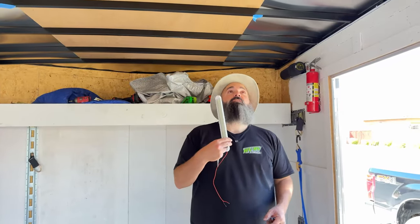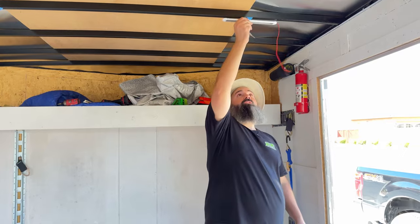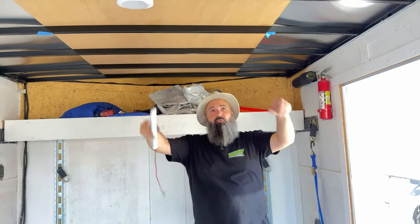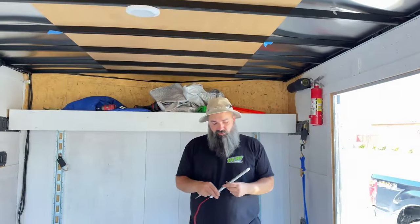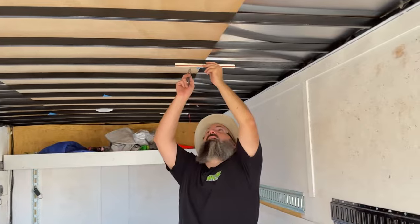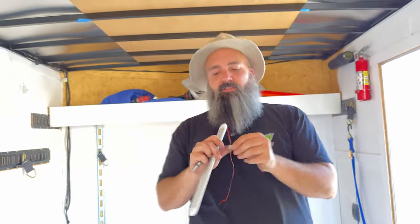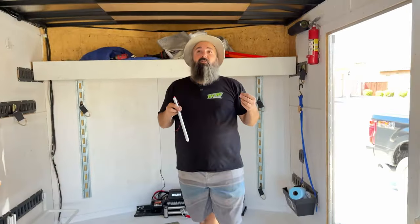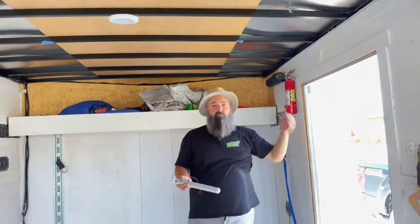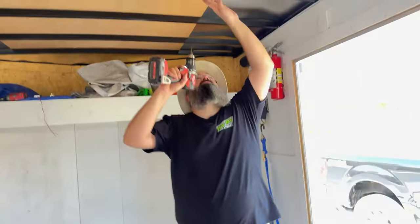So we have eight of these lights and what we're going to do is lay them out in a pattern across the ceiling. I want light right over the doorstep. What we're going to do to make this a lot easier on ourselves is use this big sheet of plywood that runs down the middle to give us some sort of reference line. These guys are just under 12 inches, so what I'm going to do is take the reference right at the center and go three inches out on either side to put these little metal spring clips in. I don't think using the sticky tape is going to work with how hot the ceiling gets here in Phoenix - this gets so hot that it's bound to melt it.